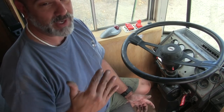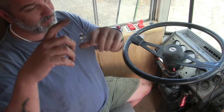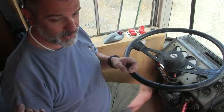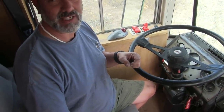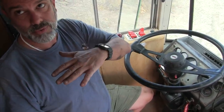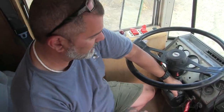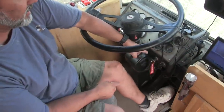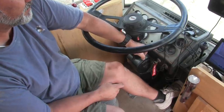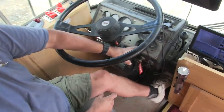So then it won't go any higher than that. The D2 regulator governor operated. So it got up to 135. The spring inside was actuated. It vented air through the unload. And that thing kicks off just like that. And it wouldn't let any more air go through the regulator to the tanks. So now it's losing pressure again, and it will continue to lose pressure until it reaches somewhere lower. I don't know what the cutoff is, probably around 100.